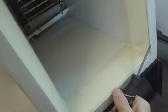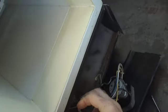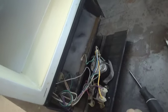We'll figure that out. Okay, so in order to disconnect the top cabinet part from the base, there are 4 screws, one in each corner, and they are right underneath here. And once we disconnect that, we'll be able to disconnect. However, because of the thermostat capillary tube, if you can see it up there, there's a piece of 1/4-inch copper tubing, and it comes out right here, goes through the wall, and that's our thermostat. And so we can pull this out like this.